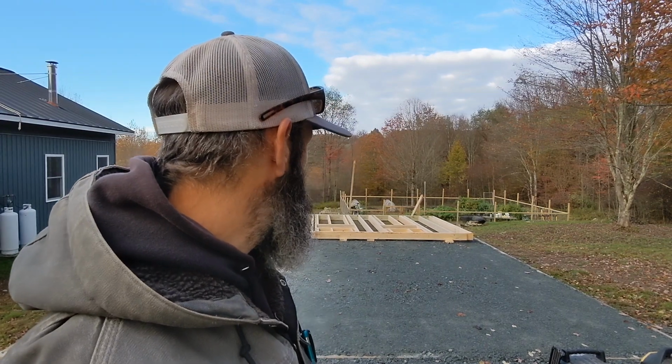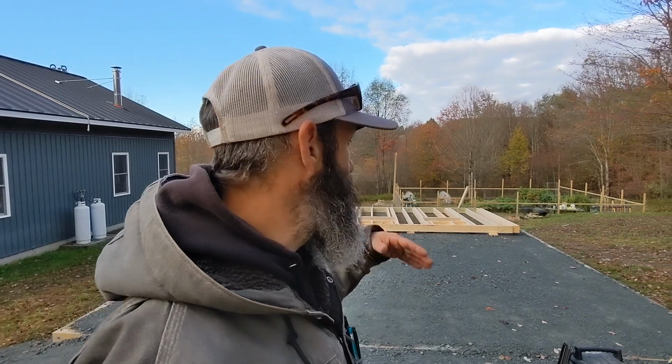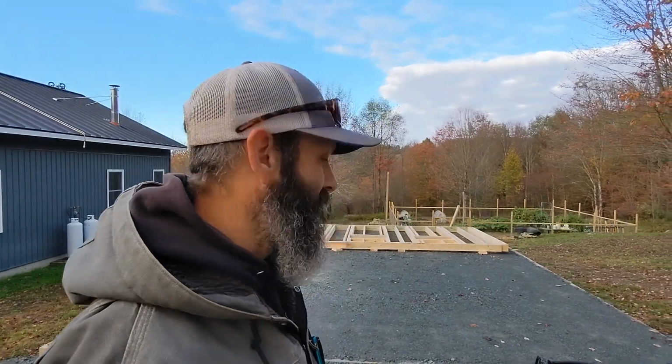But I think for right now, I'm just going to lay it out, frame, get everything marked up so that when we do get this wall up, I can just swing the bottom and top plates over, separate them, and just start shooting some studs in. That way I can maybe get this wall up, shot into the back wall so that I really get something sturdy before the end of today. So I'm going to set the camera up as usual, and I will catch up with you guys in a little bit.